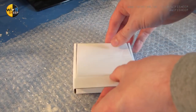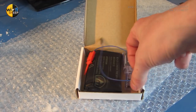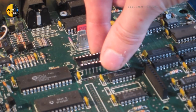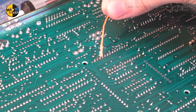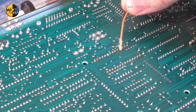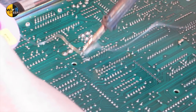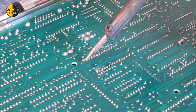Let's turn our attention to the new NULA kit. You've seen the unboxing on these before - this is the second kit. What we need from inside here is the chip holder, and we're going to fit the socket back into the board, making sure it's the correct way around - you see the little point there. Now we need to place it back into the PCB. Once done, we turn the board back over and here I am fluxing the pins. This is needed to make sure we can flow the new solder easily, just using a little bit of wire. Now with a heated soldering iron and some standard thin core solder, I'm just going to start heating up and attaching the new chip socket to the main PCB.